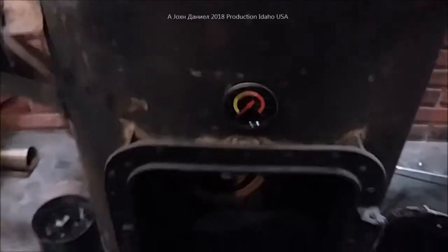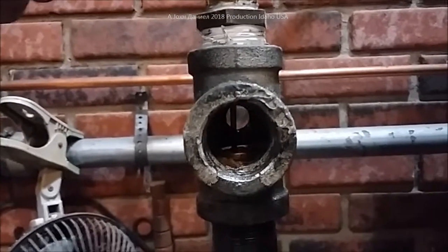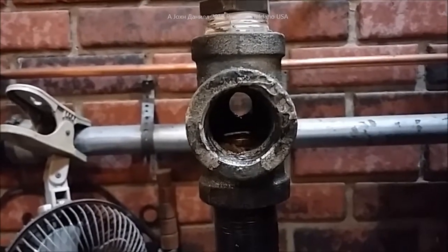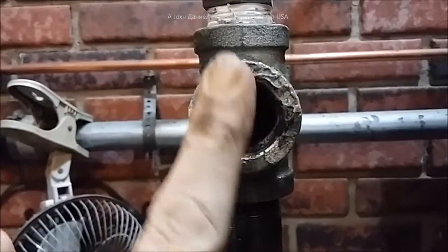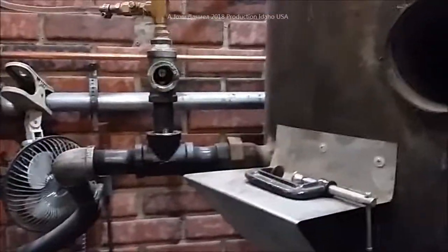We're going to go ahead and fire up the heater. My process is simple: put in the starter fuel — a mixture of mineral spirits and a little bit of diesel — then kick in a little bit of oil behind it at a tiny tiny drip. I'm going to use a piece of paper towel, throw it down in the mix, and start it with a torch. Then over here I have my timer and fan switch, which kicks on the blower outside. The blower sends air pressure in through here and creates a vortex.